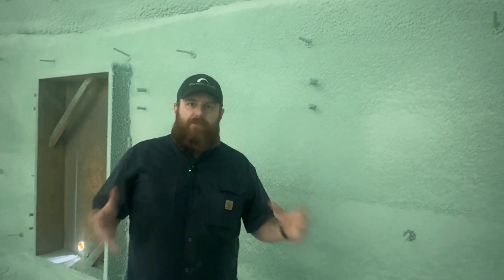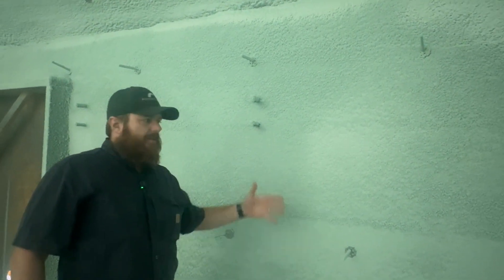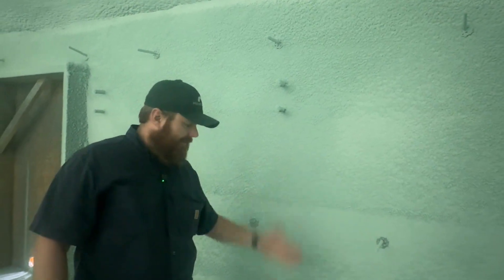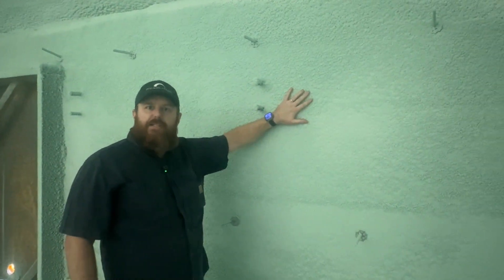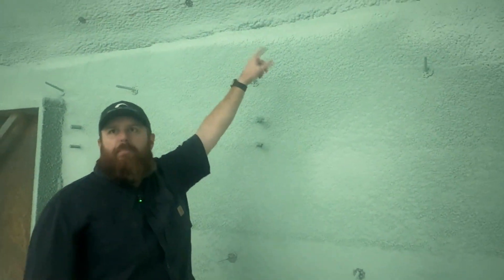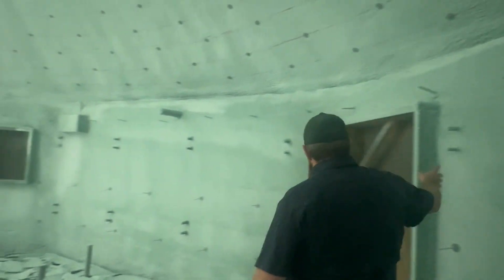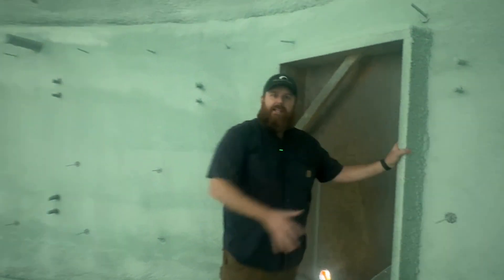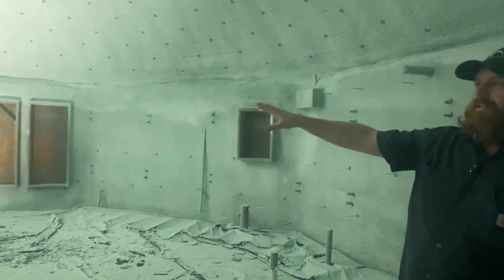On the inside, you can get a feel for what these walls looked like when they were sprayed — all of this was concrete, and then there's that transition up top. The exterior wall is basically just a facade. The structure of the dome: we'll spray a brand new structural piece on the inside. The dome is still monolithic — still one solid piece — starting from the floor and going all the way up to the top. Right now we've got two inches of foam with about an inch left to spray. We'll put a little extra foam up here to fill in before we start putting rebar and concrete on. One of the advantages of this system is that the bucks are really easy to install and easy to keep square and level — you can see over here they've got a couple of different bucks laying around.